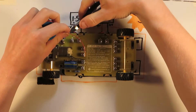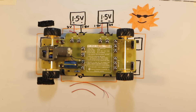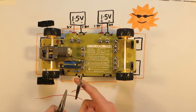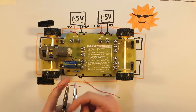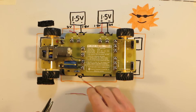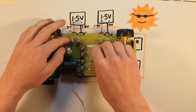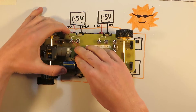Now we just need to build these wire connections in real life. So let's start cutting pieces that are long enough to connect between the terminals. Then using the wire stripping method that we talked about previously, we can strip off the ends of the wires, getting them ready to connect between each of the terminals. Sometimes it helps to create loops with the end of the wires, and with these loops you can hook them around the screw, which makes it easier to tighten them in and make all the electrical connections you need for that node.